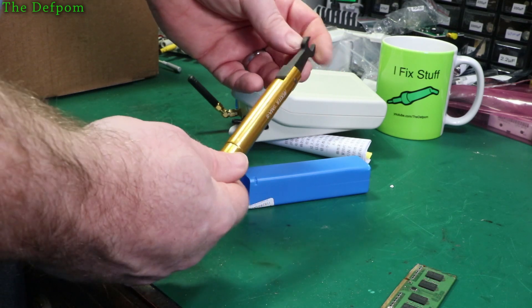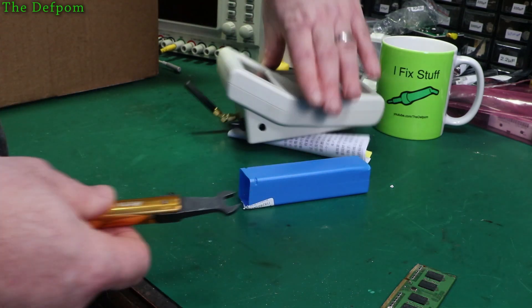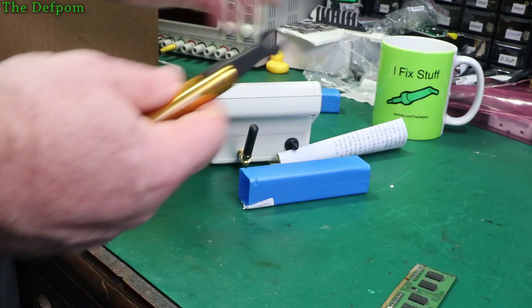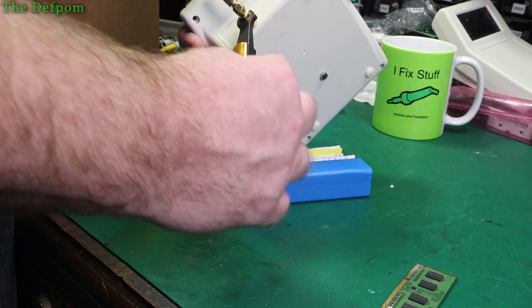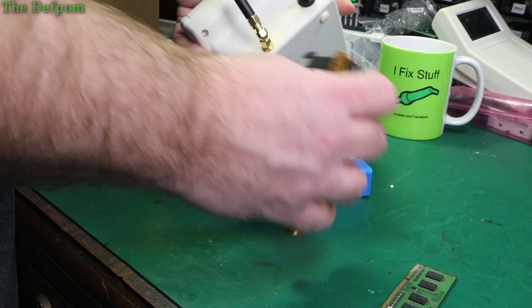I don't know - it wasn't that expensive. I think it was about 20 bucks or something. I keep doing these kinds of connectors and not actually getting them torqued properly - I'm just sort of doing them where I think they should be. Meaning if you're doing connections, you should really have a consistent torquing method so it's always done the same way. This could also be torqued up like that, and there we go - that's now torqued.